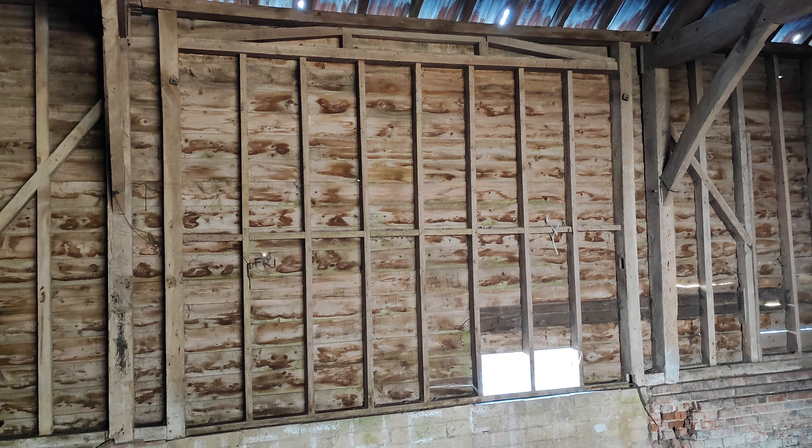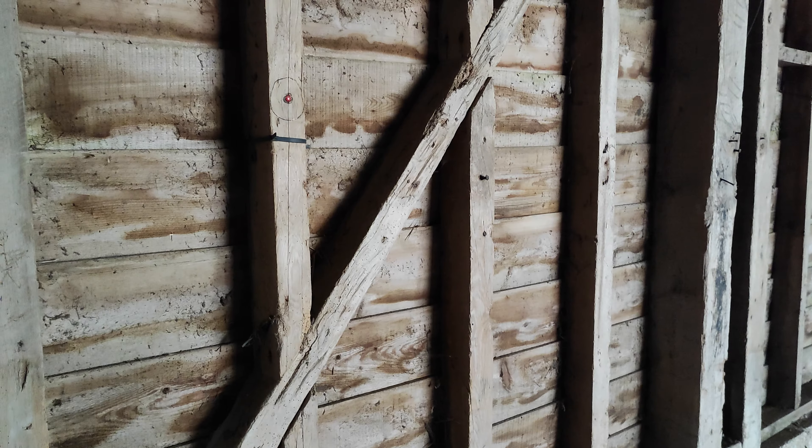Held together with nails — being nailed together saves a lot of mortising, but it also shows that a nailed building has great durability. I think this barn may stem from World War II during the 1940s, so it has already had a life of 80 years and structurally it's still very sound. It's built on a substantial brick base which doesn't appear to have a damp course, so there has been some deterioration on the plates that the building is built on. But that's all nominal and could easily be cured with damp proof injection.